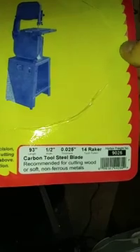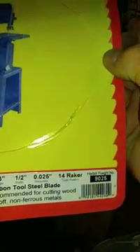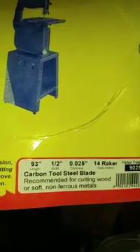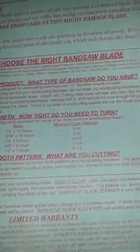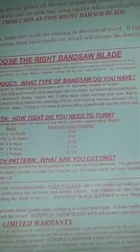I started it up, and the saw has been slowed down to about 244 feet per minute. Here on the packaging — Supercut, made in the US, 93 inches long. The blade here needs to be 93.5, but the adjustment range was just long enough. It's a 14-teeth pattern and it says for soft, non-ferrous metals. The packaging also mentions that cutting steel could damage your saw, because blade speed on most wood-cutting band saws averages 800 to 3,500 feet per minute.